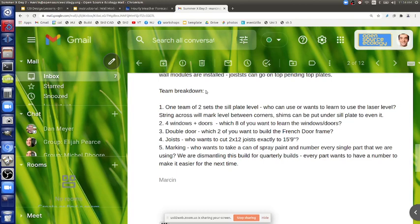You're talking about shimming the sill so it's level? Yeah. And basically, you'd be bringing up over sills to come up level with the rest? Dangerous proposition. Because I think that isn't it only that corner space over here that's higher? So three quarters of the rest is level? What we have to do is we measure where exactly the level is and decide from there. We might want to just say, oh, we leave it because it's actually not going to work out.